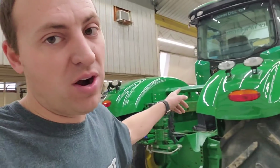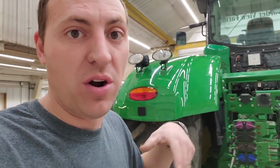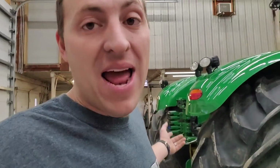These ones in the center, they're a little bit harder to get in and out of there because you've got to do it by hand, and they weigh over 100 pounds a piece, and it's tight getting in and out. So I didn't put those on when we first started ripping this summer, and guess what? It worked okay. Turns out our 2730 ripper pulls easier than our 15 shank chisel plow does. And so I never added them back on this fall because I really didn't need to.